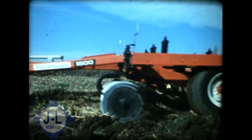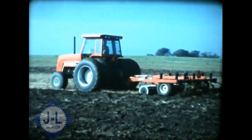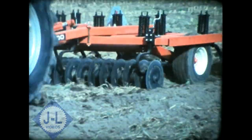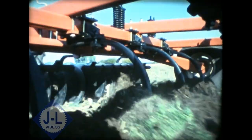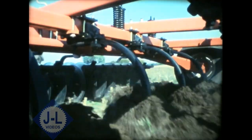The 1500 min-till combines two of the best conservation tillage methods into one energy-saving implement. 20-inch front coulter blades, spaced 7 inches apart, cut through the heaviest trash, eliminating the need for prior disking. And chisel shanks break hardpan up to 12 inches deep, incorporating 50 to 60% of the residue.